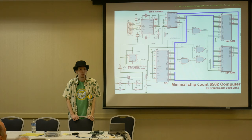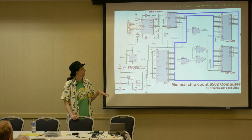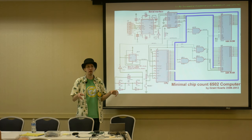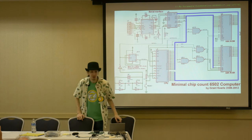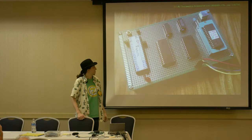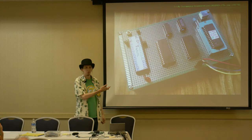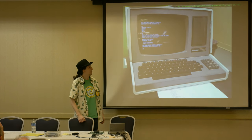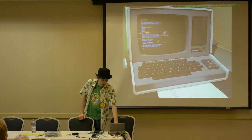In my travels, I come across Grant Searle's minimal footprint computers based on the Z80, 6809, and the 6502 — doing it in just a handful of chips using a serial interface. The first time I'm looking at this, the chip interactions make sense, the memory layout clicks for me. I built one of these. You can run BASIC on it — OSI BASIC in ROM over a serial link, talking to it over my H89 acting as an H19 terminal. You're using the 6502 pretty powerfully with a lot at your fingertips.